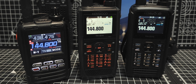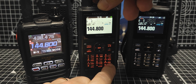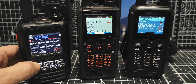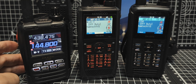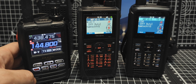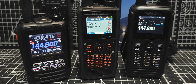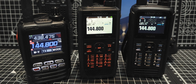If we send a beacon TX from the D74 by pressing Beacon, we get the retransmit. If I try to send it from the FT5, in theory it won't retransmit - let's see. Press F. Yeah, see - it didn't retransmit. You only hear one transmission. It's transmitting its APRS - 'Hamtech 5 FT5' - working fine. If we were out and about, that would be transmitted worldwide if in range. But if it was transmitting to this on a hill, it would get a further local range.